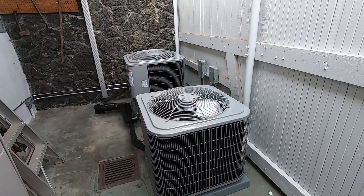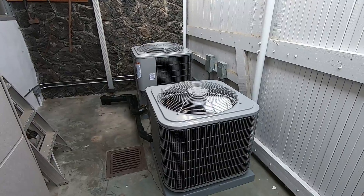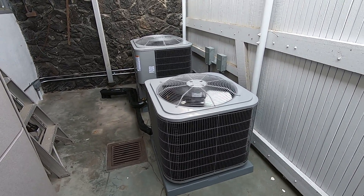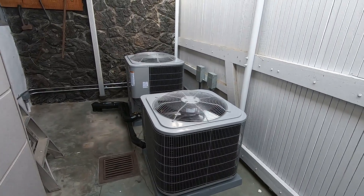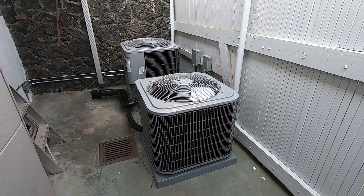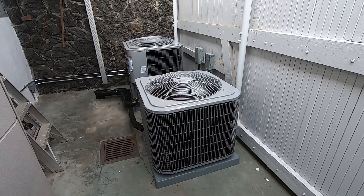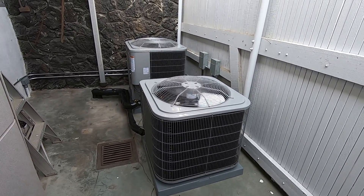Natural gas does have a higher temperature output than electric heat does. So you need to remember to maintain the heat when you are running a heat pump system. If you were to wake up very early in the morning and it's cold outside and cold in your house — you turn on gas heat and it can heat up fairly quickly. With a heat pump system it might take a little longer; it will heat your house, but it will take a little longer. So we always ask customers to maintain heat. Also, these units will actually condensate when they do defrost mode. Sometimes people will walk out after a heating cycle and see a puddle of water underneath the unit. We have a drain right here so the condensation runoff will go into that, but there will be a little condensation after heating cycles during defrost mode. Obviously if you're going between modes — cool to heat — you will also see that condensation.